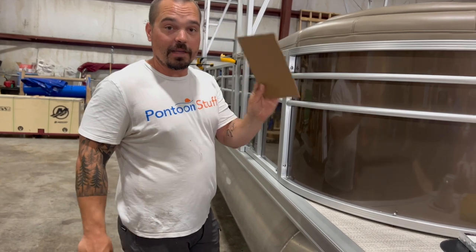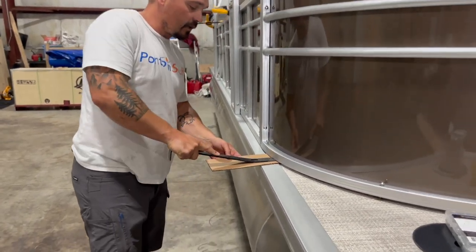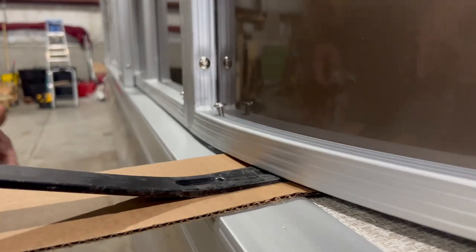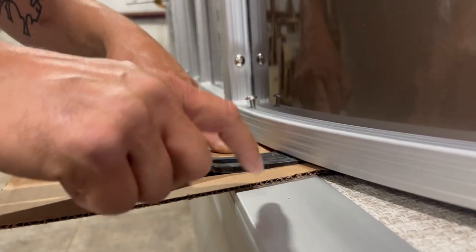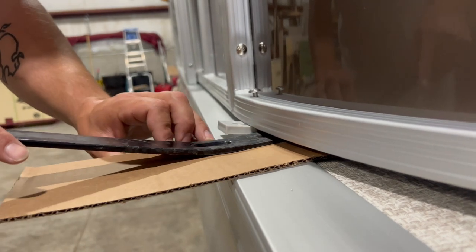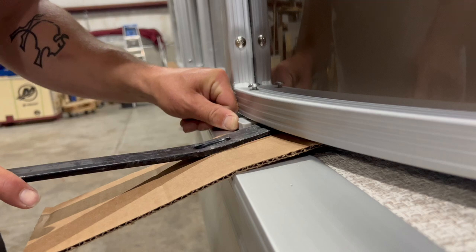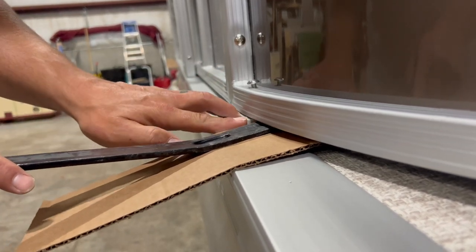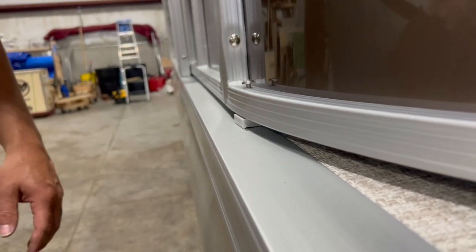What I do for that is my scrap cardboard and a pry bar and I just get underneath the railing to where I can lift it with gentle pressure. This cardboard is going to protect the vinyl floor and also my new deck trim, and I can lift the railing just enough to slide my fence riser under. Then take the pressure off with the pry bar and my fence riser is now right in position.